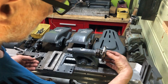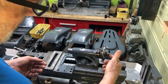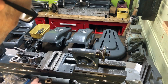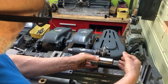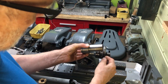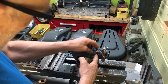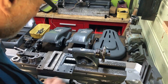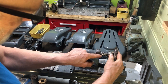The second thing is the annoying problem that occurs when you wind out the tailstock and the screw, which is integral with the barrel, interferes with the action. I have a friend who made a very clever modification where he extended the barrel so that the winding action is out here, with the barrel extended by a tube fixed to and rotating with the handle, while keeping the nut in place. I will try to replicate that.